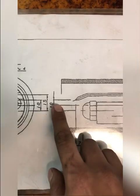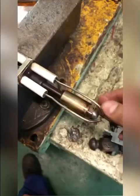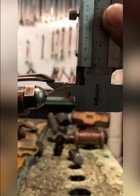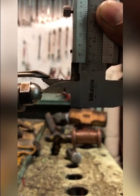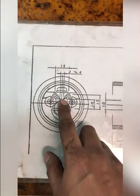You can see this is now 7mm. Now we will adjust the 10mm vertical distance between the tip of the nozzle and the electrode tip. You can see it is now 10mm. Now we will adjust the 3 to 4mm distance between the two electrode tips.